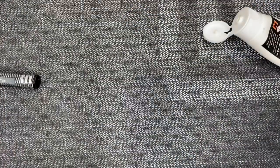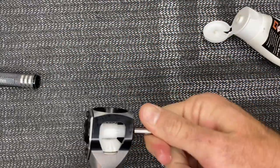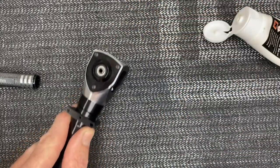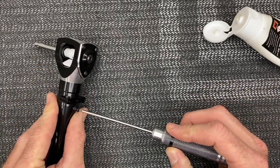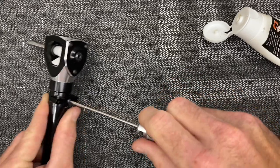Look for that hole and the thread — that's going to slide in. Push the torque tube until it engages with the actual gears. We can see it's spinning now. Take your M3 by 6 millimeter screw with loctite and run this into here, letting it lock itself into that hole of the boom.